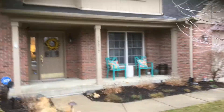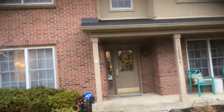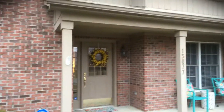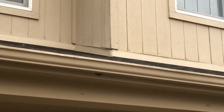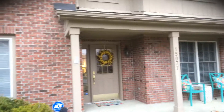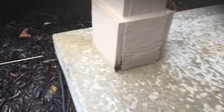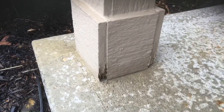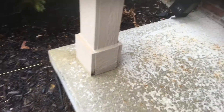The framework, a couple of areas of wood trim around windows — there is one area I can't really see well, but as far as wood repair goes, looks like there may be a concern there. I can't get up there and check, but that's something we could look into. We'll assume it's okay for now. You might just have a little bit of swelling on that wood, and that happens when you have this compressed board — indicative of that right there. You've got some swelling at the bottom, so stuff starts to fall away. This cap right here at the bottom would need to be replaced.